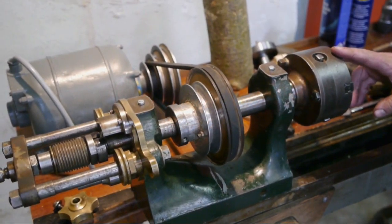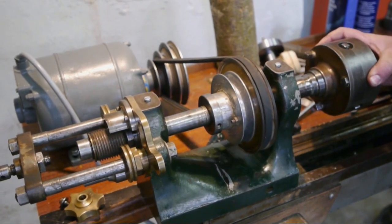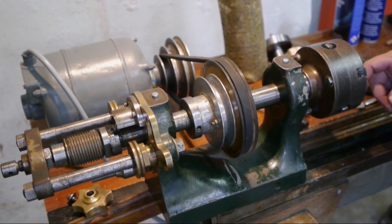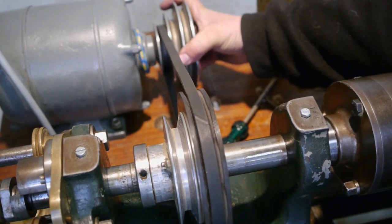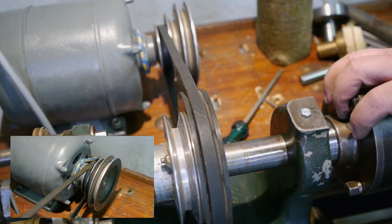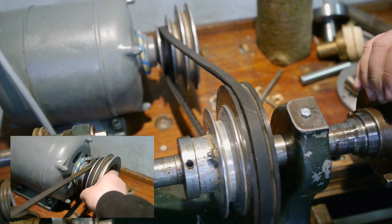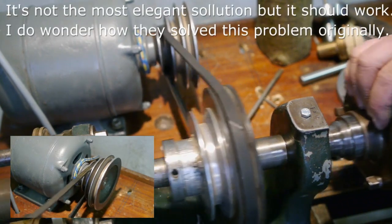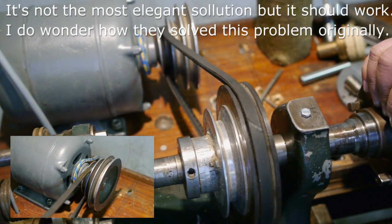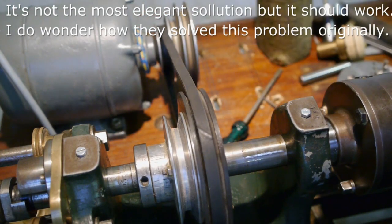This old machine that I've been using as my wood lathe has a sliding spindle screw cutting mechanism. I'm going to sell this lathe but before I do so I want to try and cut some thread with it. I've loosened up the bolts that mount the motor to the bench, because when the spindle moves forward it tightens up the belt. This way the motor is allowed to move a little, and I'm using a bungee cord to pull the motor back.